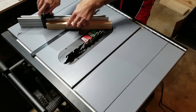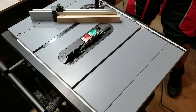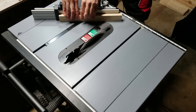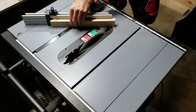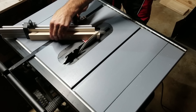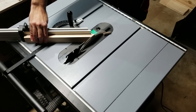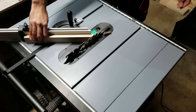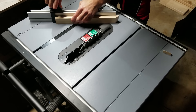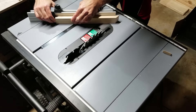The reason I cut these pieces on the miter saw a little longer than 13 inches is to give myself wiggle room in case I take too much off on the first pass and don't have to start over. I make a first pass here, and on this one I didn't quite take off enough, so I slide the stopper over a hair to take off a little bit more. Then flip it around, make another cut, measure it, and if it's still a little too long, slide the stopper over so it'll be exactly the length you need.